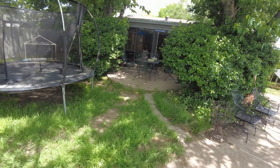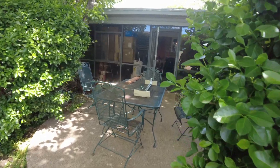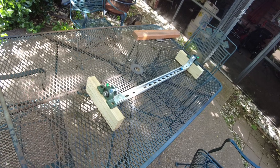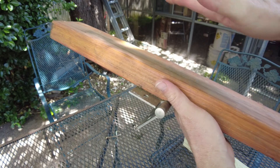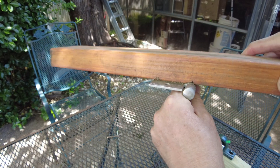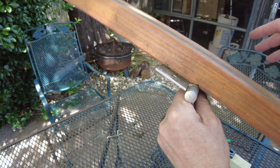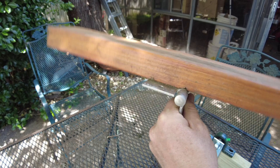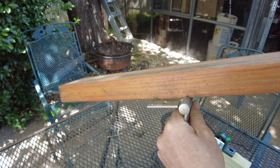Some of you may already know that I've dismantled my solar tracker that I built a while back. I wanted to redo it, and this right here is kind of the start of redoing it. The original way I was doing the tracker was having the solar panel sitting on top of a 2x4, which was resting on a hinge, putting the center of the weight above the hinge. It worked okay, but I think that was making it difficult for the linear actuator to move it properly.